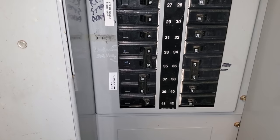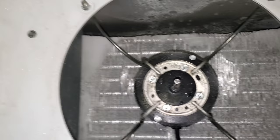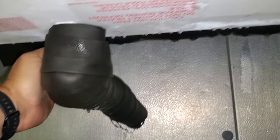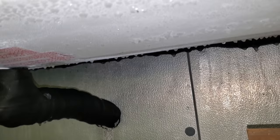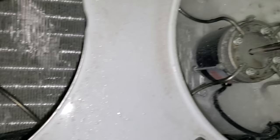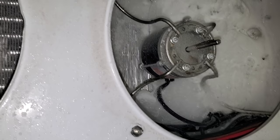So what we're going to do is power this down and defrost that coil, then try to find some sort of an electrical short or see what's going on - maybe the ice pulled the wire nut off. We've got a lot of ice in this thing. It's very interesting how there's more ice on the left and more ice on the right than there is in the middle. There's also a ton of ice in the drain pan on the left and a ton of ice in the drain pan on the right. We've also got different motors.